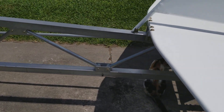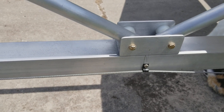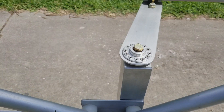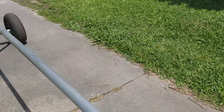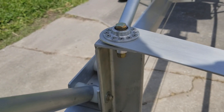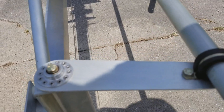Tail is covered. Wings are in the garage, not covered. We have some simple little cable ties here as guides for the rudder cable. I opted to place my bell crank for the elevator support right here — I was able to utilize some existing hookup that I already had. That's just a piece of angle aluminum coming up on top, and built just per the plans is the bell crank.